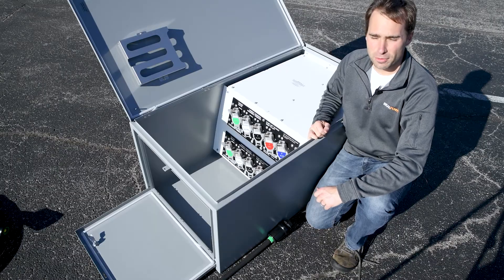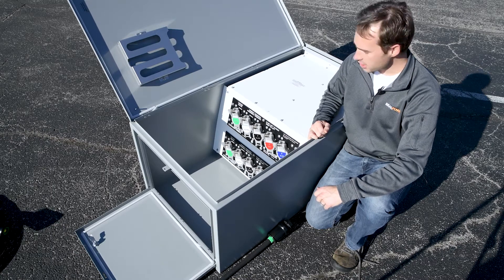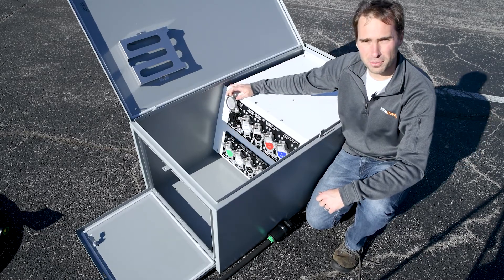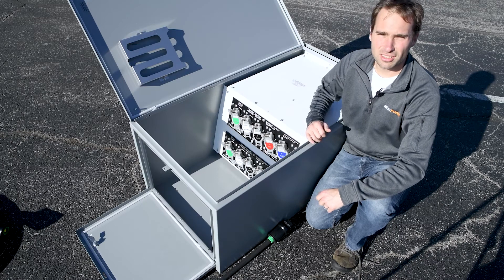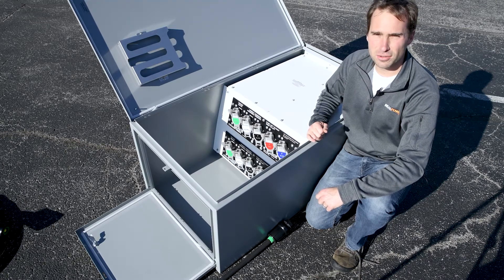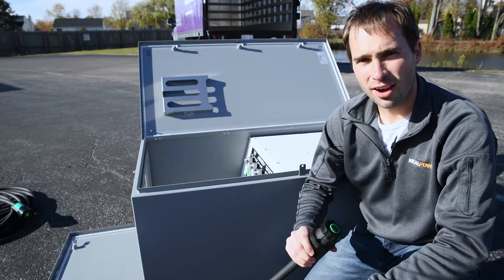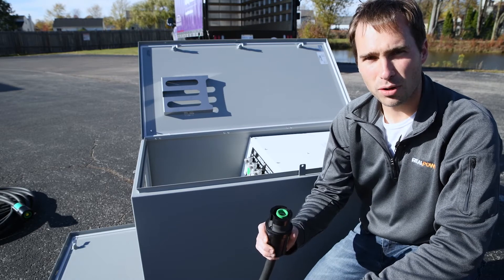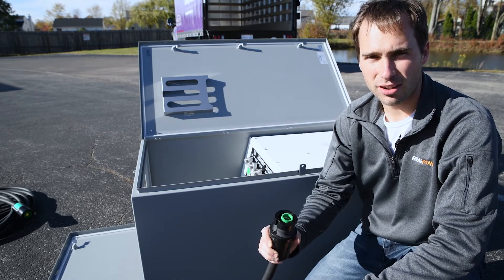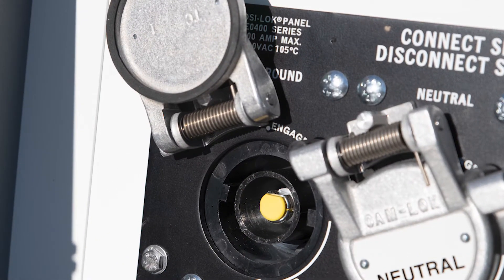I've laid out as an example this 208 volt 800 amp panel and the first thing you'll notice is that none of the doors will open except for the green ground pin. This is intentional — it ensures that all of the cables are plugged in in the correct sequence to ensure safe connections. Also note the cables are one-way directional. The end of this cable is the female connector and the panel connection is a male inlet. It's going to be the opposite way on the truck side.